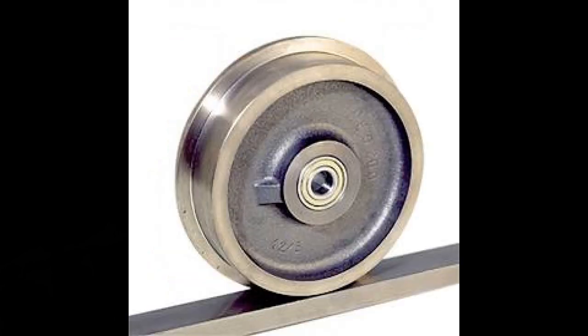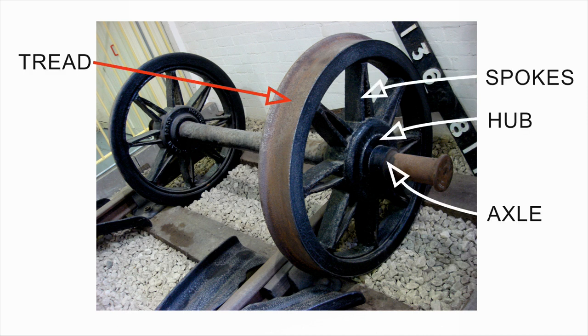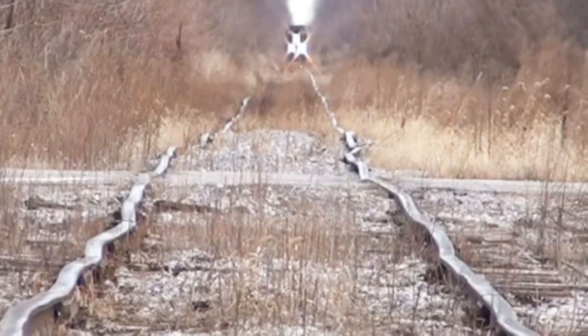So as usual, I've had a go at making my own. As you know, railway wheels need two particular things: treads and flanges. The treads sit on the rail and the flange stops the wheels sliding off sideways — both important. If your rails are even and level, you can get away with modest treads and modest flanges. But my railway might look more like this, so I'm going to need generous flanges to keep the wheels where they're supposed to be.